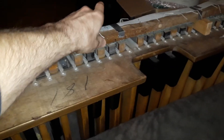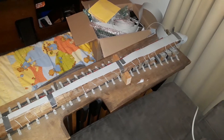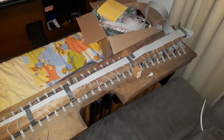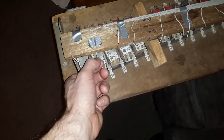The wiring is not overly hard, it's just fiddly and quite a quantity of wiring. I've chosen to use ribbon cable, very much like how some old computers were designed. This is a 50-strand ribbon cable which I've separated off to have 32 notes plus an additional two wires for the earth. Basically the MIDI pedal board works with approximately 5 volts DC down to earth as the switching mechanism. I've just loosely attached the ribbon cable with some duct tape at the moment, then individually cut each wire to the correct length — all fed off this main ribbon cable.